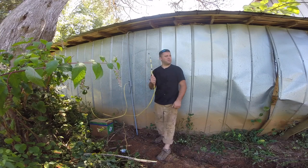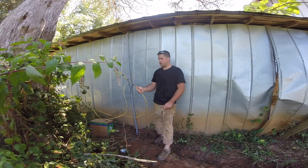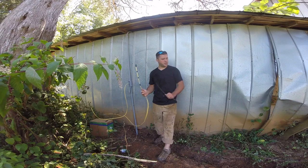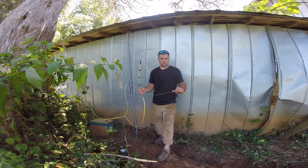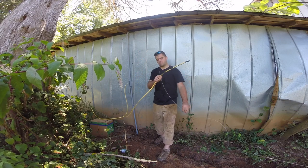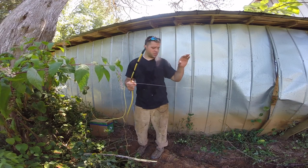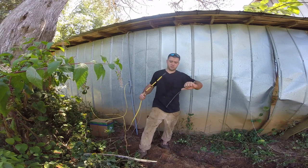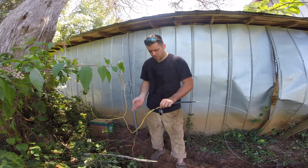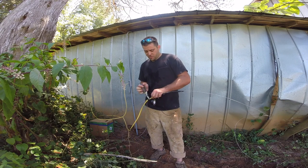So I unplugged my tiny house and I unplugged it from the breaker as well. Now I need to put this wire through this box and down all the way through the conduit. I might be able to push it through, but just in case I'm going to use this thicker gauge - it's got to be 10 gauge maybe. I'm going to push this through the conduit and then pull this as well as push this. I taped it on there for about a foot and I'm going to bend it back on top of itself so that it won't come out.